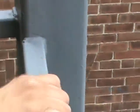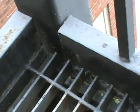Again here, clip, also on each side. This is a major structural piece. And if you look at the connection of the channels to the post, we see the same thing that we see in other buildings. One side has bolts and the other one is totally relying on the weld, and we cannot do that. So we need to put bolts in the welded areas.